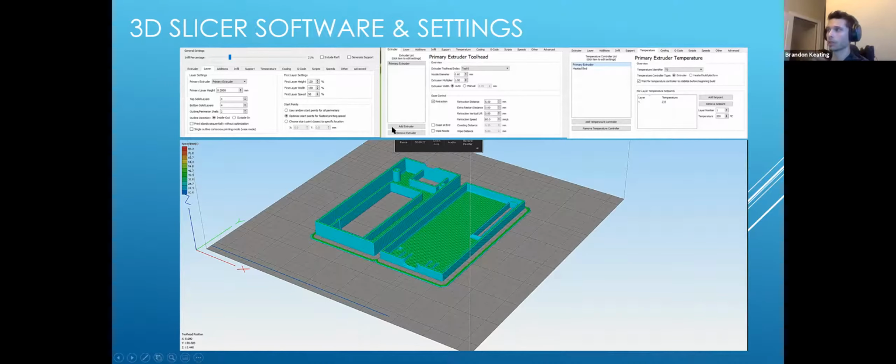We're also doing it fairly slow because material is another huge consideration. There are a lot of different 3D printing materials out there. The most common is PLA. It's also the easiest to work with. It's also one of the most brittle. Well, not brittle, but it's not heat resistant really at all. So I essentially print exclusively in PETG, some kind of polyethylene plastic. It's very strong stuff. It is very thermally resistant. You could leave it out in a Florida sun on a hot day and it won't melt. PLA will turn into a puddle in a couple hours.